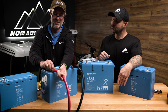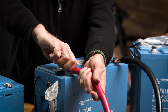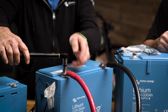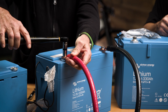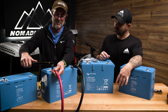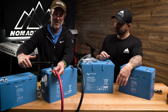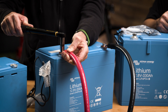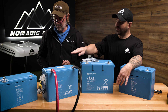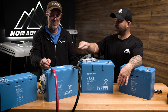This one has an M10 or three-eighths bolt, which is okay, but if I had my choice, I would put a five-sixteenths or an M8 on there. We always want to hand-tighten as much as we can. We want to be at the end of the torque wrench where the handle is — they make that knurled knob there for a reason. That's where we want to be so we get the exact torque we want. Go nice and easy, feel for that torque, and listen for it to click. If it clicks twice, you don't want to keep going.